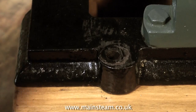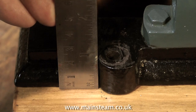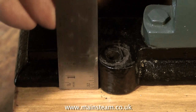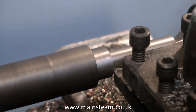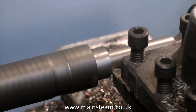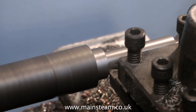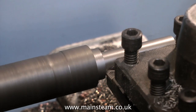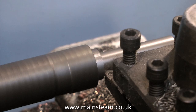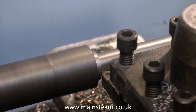Fitting a plug like this into a hole in a piece of cast iron seems like a very simple job, and indeed it is, if you do it right. If you do it wrong, you will have major problems. Possibly the worst case scenario is to turn the finish diameter over size and then force the part into the hole — and then the cast iron bed plate cracks, and the thing that you're working on is irreparably damaged. I much prefer the Loctite principle — more about that later.